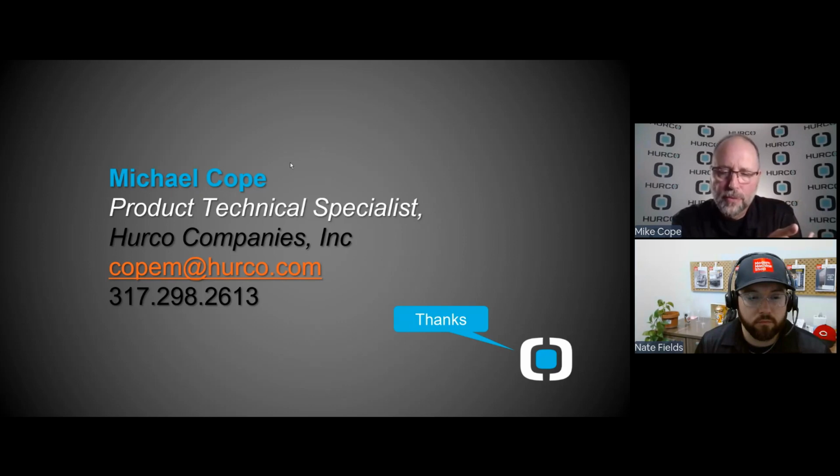If you did have a 3-axis CAM system, you can also merge our conversational with NC, so we can use conversational transform planes to orient the part and move work 0, and then call in our existing 3-axis program. So there are some ways to do it without having to go with that large expense. Obviously, if you're going to be doing simultaneous machining, you have to have a CAM system. We don't have anything for that, but there are things you can do without having the expense of a CAM system, especially if you're looking at a Hurco.